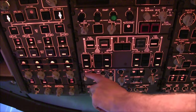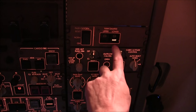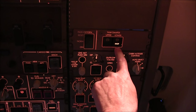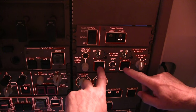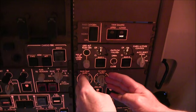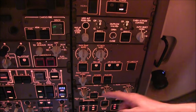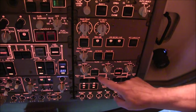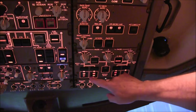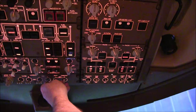Wing anti-ice on this type would be in auto — flush switches and vertical switches. Passenger oxygen: leave it alone. Yaw damper inop doesn't mean it's broken; it will come online when the first IRS aligns with position. Pressurization: check the two manual switches are proud, not pushed in. Vertical switches throughout. Aft cargo heat stays off as it will bleed for engine start that we don't need. Vertical for equipment cooling. High flow and pack reset normally stay off. Pack switches are off; isolation valves are flush. Flush switches for the bleeds as well.